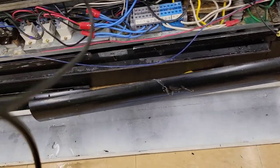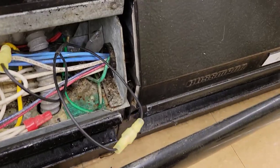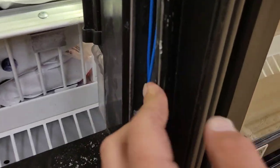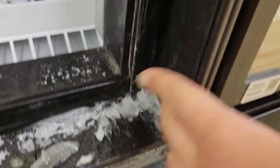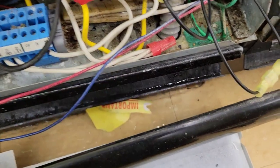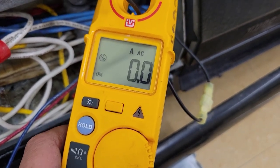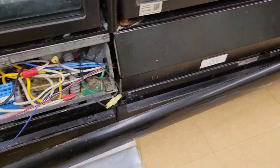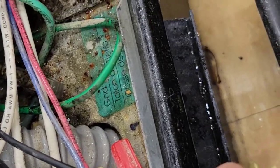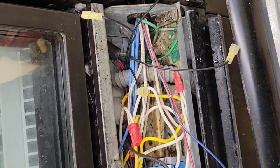The first thing we're going to do is check voltage on 11 and 22. Terminal 11 is right there and 22 is over there — we see we've got 120 volts going to the wall wires. You can physically trace out these wires: the heater slides right into that spot, goes down through there, and one side goes to 11 and the other side goes to 22. Now if we take an amp draw — nothing. So now the only thing left is to take continuity. I have the meter on one side of the heater and the other side, taking ohms — and I have an open line. That heater doesn't have continuity, so that heater is burned out. It's junk. We need to replace it.